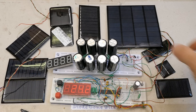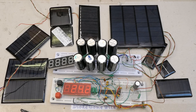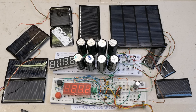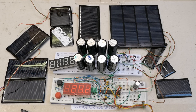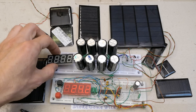When using the red display I can rearrange this into two parallel sections; for the green one I would have to have all in series, which would double the voltage but halve the current. I also prefer red, yellow, or yellow-green displays because in the dark you can see just the display — a pure green or white or blue display lights up the walls a couple meters away. Human vision is probably much more sensitive in the dark to shorter wavelengths, so if you want to use it in a room where somebody sleeps, the wavelength has to be over about 570 nanometers. I also notice that the red display is much more readable from a distance than the green one despite being the same size.